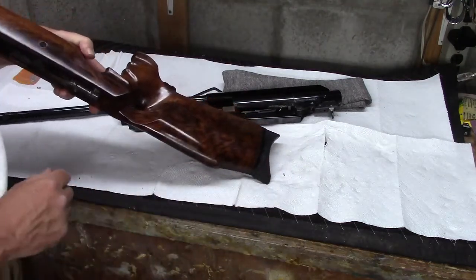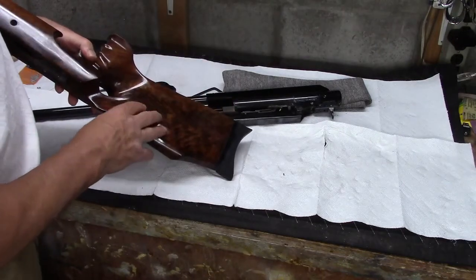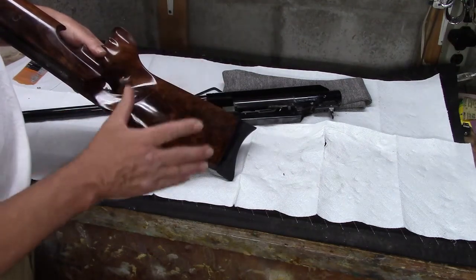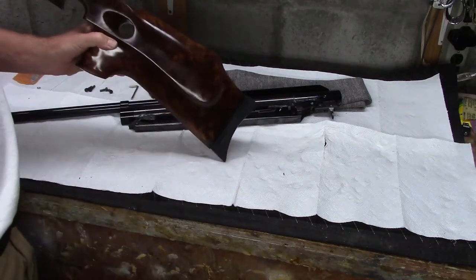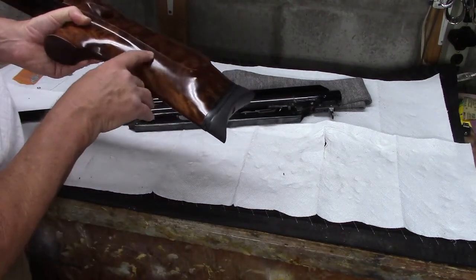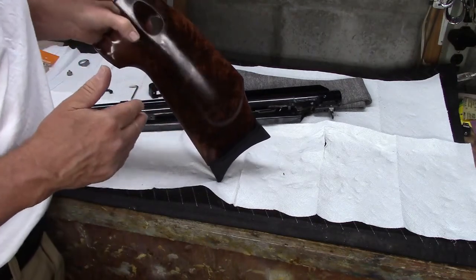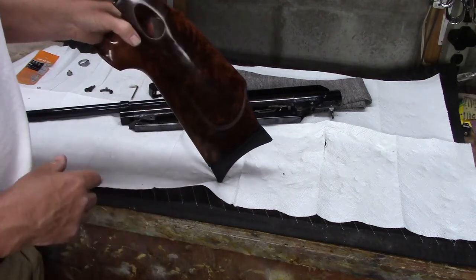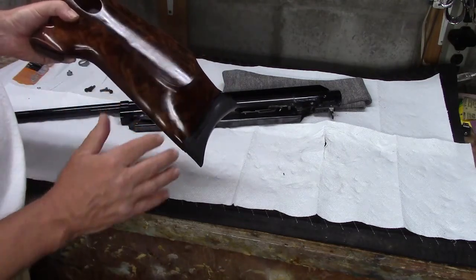I would not let this gunstock sit in the sun and get hot. I allowed that and I can see — I remember when I first made this gunstock there were drying cracks happening and I filled a bunch. While working on it, I put it out in the sun to help kick off the oil, but that turned out not to be a good idea because it opened up a couple or three drying cracks. These are microscopic — hairline little fissures, just little openings of the surface of the wood. The thing is, they won't take oil. So for those few, I sanded it down, filled it with laminating resin, and oiled it back up again. They're not a problem.